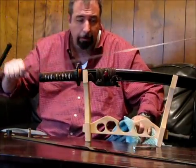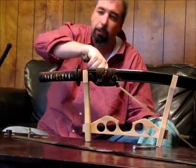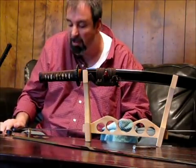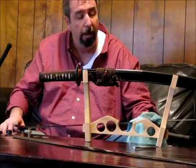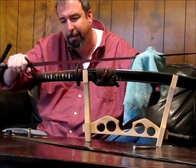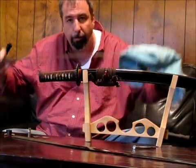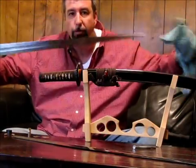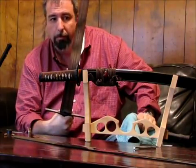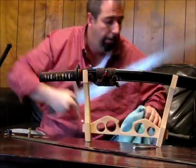What they would do is through harden the blade, usually by heating it after being shaped and forged, and quenching it all, or interrupting the quench in a medium, and bring it up to a high hardness of 57, 60, 62 Rockwells, which is a measure of hardness, and then temper it by heating it slowly, bringing it up to temperature, and letting it slowly rest at temperature, which brings the hardness down. And then that results in what's called a spring temper, which is a nice flexible sword that returns to true, and it's still hard enough to hold a good edge. This was the European answer. Again, the Japanese were dictated by the materials they used, where the Europeans did this.